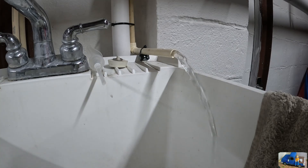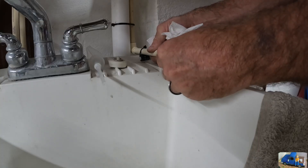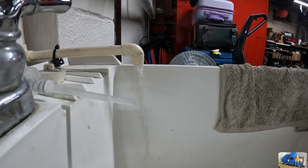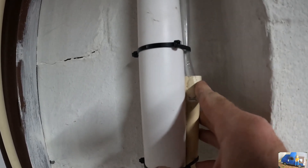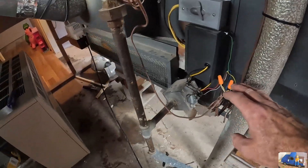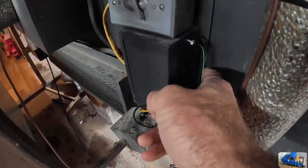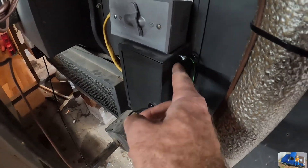Wow, that comes out faster than I thought it would. Now we're going to put an elbow on that — this elbow was 39 cents. Give it a couple seconds to secure and then we'll fire it up. Keep an eye on this — it's stuffed in the end of that coupling. I don't think it's leaking, but if it is we'll have to get in there with some silicone sealing. This unit does have the relay built in there to switch it. The green wire from the thermostat is the fan trigger for the AC, and the ground just goes up to our relay.